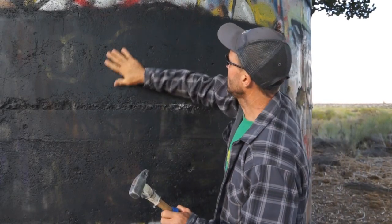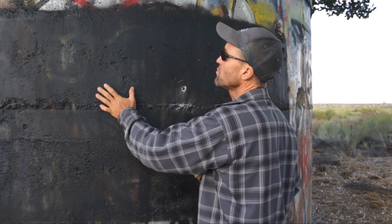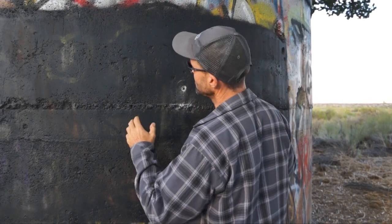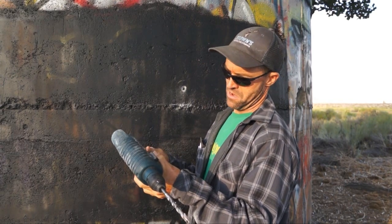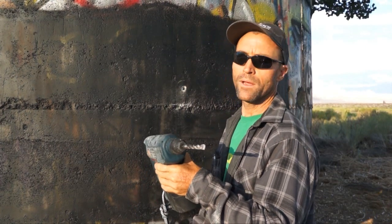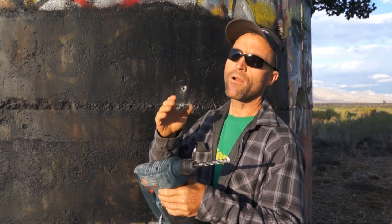So let's drill a hole. Obviously, if this was a chunk of stone, we'd want to make sure where we're placing this bolt that we don't have any loose flakes — it's a nice solid area. Whether I climbed up to this position on lead or rappelled down, I want to make sure this section of rock is in good shape. One of the things I like to do is kind of oval out that first little section of hole, maybe the first eighth to three-sixteenths of an inch, so it's not such a square angle and it's a little easier for the bolt to get started and seated.